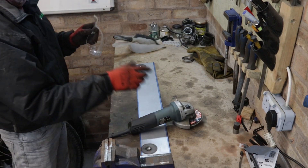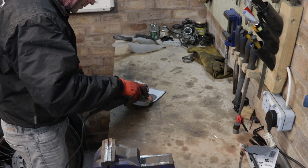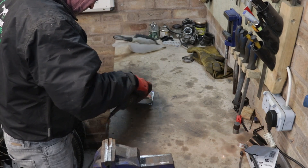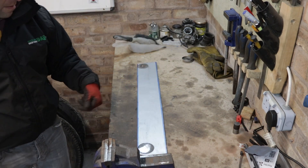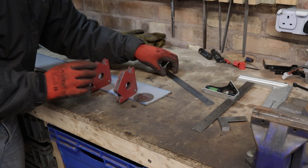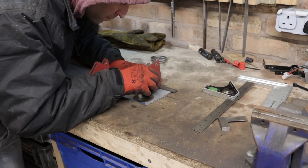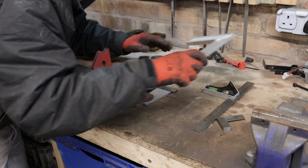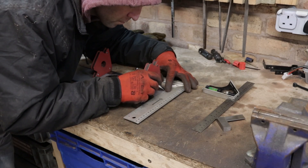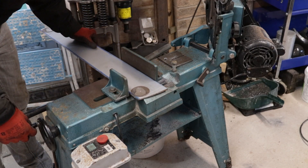What I'm doing now is cleaning up the material. This piece of plate used to have some feet for supporting the TV stand. I drilled out the feet because they were spot welded in place and I'm just left with the remnants of the spot weld, so I've taken a flat disc to that just to flatten them down. Now because the material was cut with a grinder it has left some jagged edges, so using two welding magnets and a ruler I'm going to create a straight edge to work from along the piece of material.